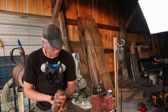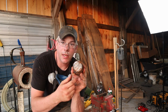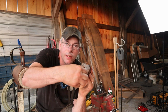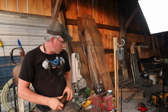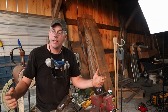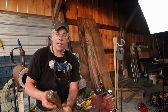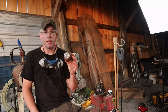So what we're doing here, and I'll just explain it a little bit. The handle's going to come up through the bottom here. If you could see, I have two lines scored in right there with the bandsaw. So I'm making a peen hammer, kind of diagonal. The reason I'm doing that, I'm finding with the cross peen hammer, it's very awkward to hold your material straight on the anvil and hold your hammer straight. It's not a very natural movement. It's normal for me to hold the material out a little bit with one hand and kind of come at it like that. So I'm figuring something with a diagonal peen on it will work a lot nicer, and I swing the hammer with both hands, so I'm probably going to put the opposite diagonal peen on each end, so no matter what hand I'm swinging the hammer with at the time, I'll be able to do whatever I want.